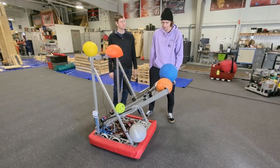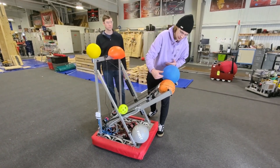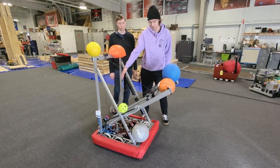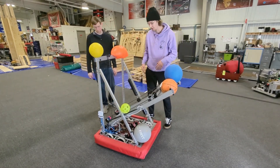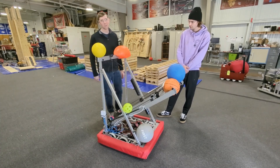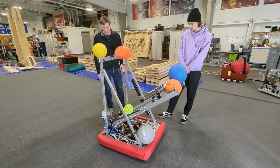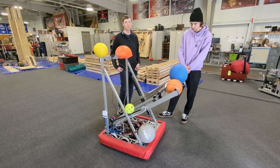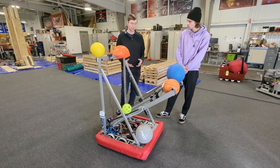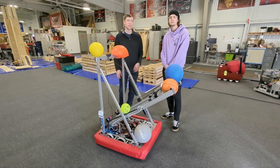To wrap up with a few final notes — a few things we would change about the robot. For the gripper, it could grip the cones a little bit tighter, which could be solved by grabbing the cones higher or adding something that comes in closer. We'd also adjust the motors so the entire robot is legal in the starting configuration by adjusting the pivot in a little bit. Cameras are a really useful addition to see the cones and cubes across the field, as identifying them when far away is difficult. Programmatically, we would put more time into PID tuning for the position of the pivot and extension — both were roughly tuned, and with better tuning you could get nice automated buttons, like a button to go from ground to grabbing at the scoring angle, which would make driving the robot a lot easier.